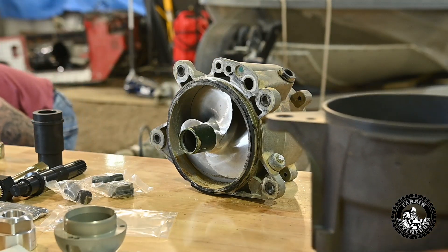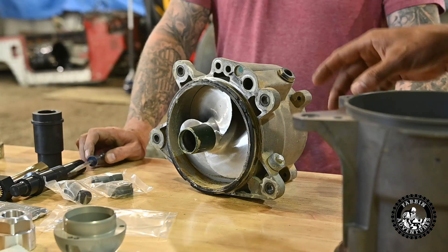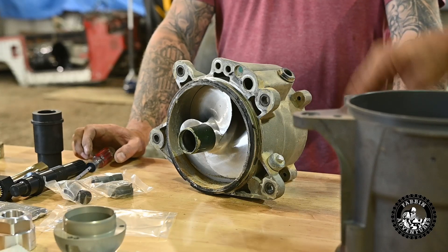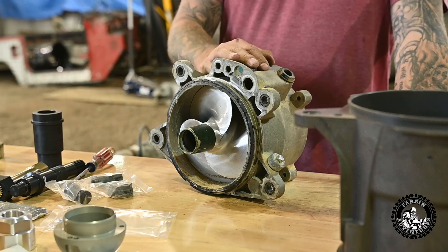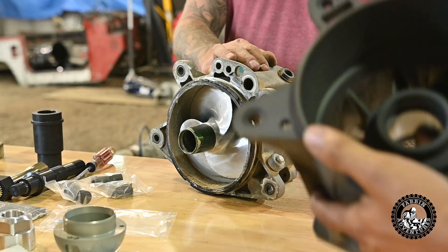This here is the new pump with the adapter, and that's the old pump. You're going to pull all the guts out of the old pump and then put in the Munster parts. For the front pump — the one closest to the boat — it'll have a 155mm wear ring and impeller.